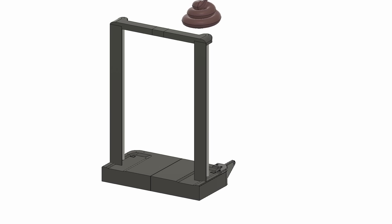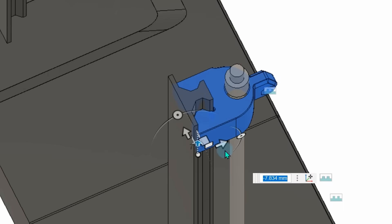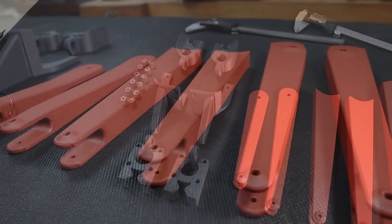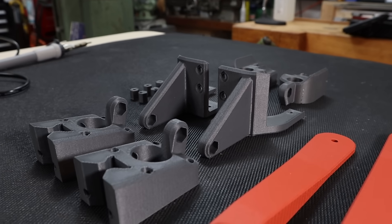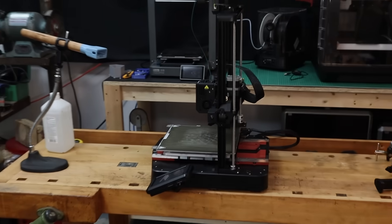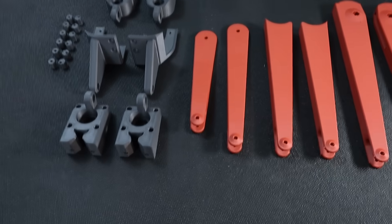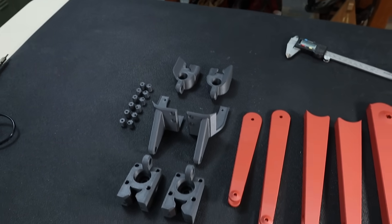To connect everything to the printer I wanted it to look like it belongs, so rather than sticking something on top I've placed things underneath. The upper and lower adapters for the post have a cutout that fits snugly around the post profile. All of the parts for this project are printed in PETG carbon fiber — the arms in brick red and the adapters in titan gray. I used the Bambu Lab X1 Carbon and the Ender 3 version 3 metal frame printer, since I had to take the KE apart for this project.